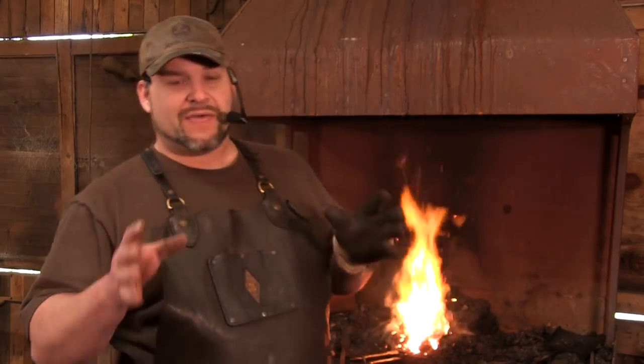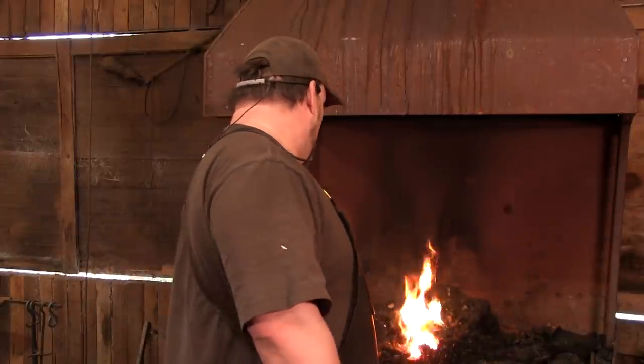One of the reasons that I've got the 3/4 lined up with the 3/8 is because everything's nice and neat. If I do half the thickness of 3/4, that's the thickness of the boss. Half that thickness, that's the thickness of the jaw. Put them together, it's 3/4 of an inch wide, which is a good size for a tong. So that's where these numbers line up. And you have to think about the numbers and what's going to go where.